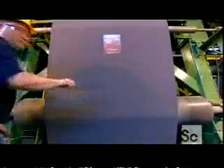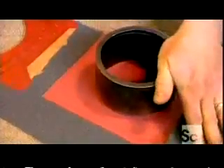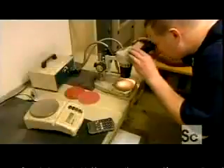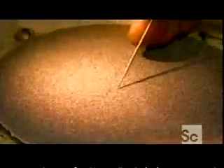The grain-coated cloth now rolls out of the pit and back up to the main level of the factory. A technician cuts a swatch of the sandpaper, then peels away layers and makes three different cut-outs: one of the cloth alone, another of the cloth with the adhesive coating, and a third of the grain and adhesive-coated cloth. He weighs each cut-out to confirm that the sandpaper has been formulated precisely to specification. He also examines the gritty surface under a microscope to make sure the grains are standing up evenly.